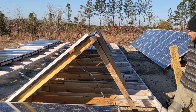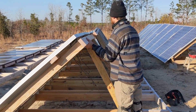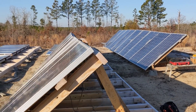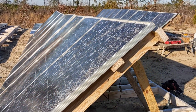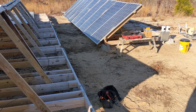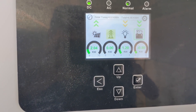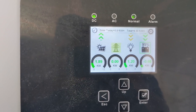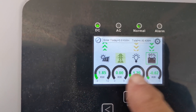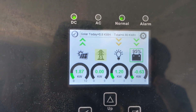Day three — we're finishing up and doing a little testing with all 36 panels wired together flat. We're only making about a kilowatt at nine o'clock, but Abraham's setting up and we've still got some inter-row shading with the sun coming up. We've got two strings of nine wavy panels with a little shade on one corner. We are making 2,000 watts with the solar now — matching the load of the pump and still charging the battery. It's still matching the solar, so the system can limp along a little bit.